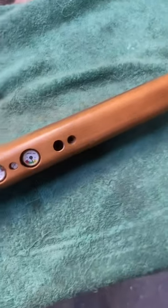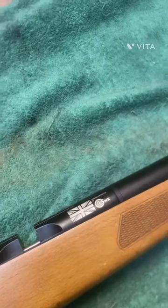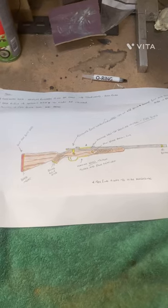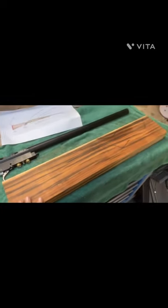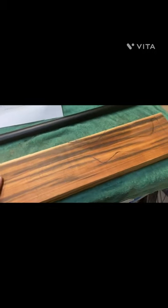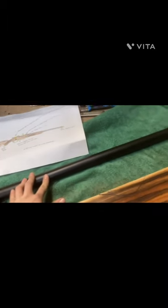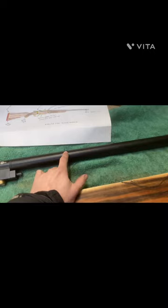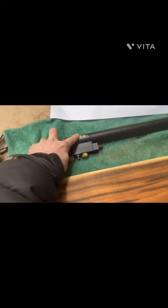It is regulated and a nice platform to start on. My plan is to make something like a Wesley Richards type classic big game rifle. I've got hold of a nice thick slab of tiger wood - a Brazilian tiger wood, very dense with a nicely grained hardwood that I think will look really nice. I've stripped down the action and I'm thinking about reshrouding the barrel to bring the size down, because it's a big 35mm diameter barrel. That might complicate things though, as it won't fit the top of the receiver properly.